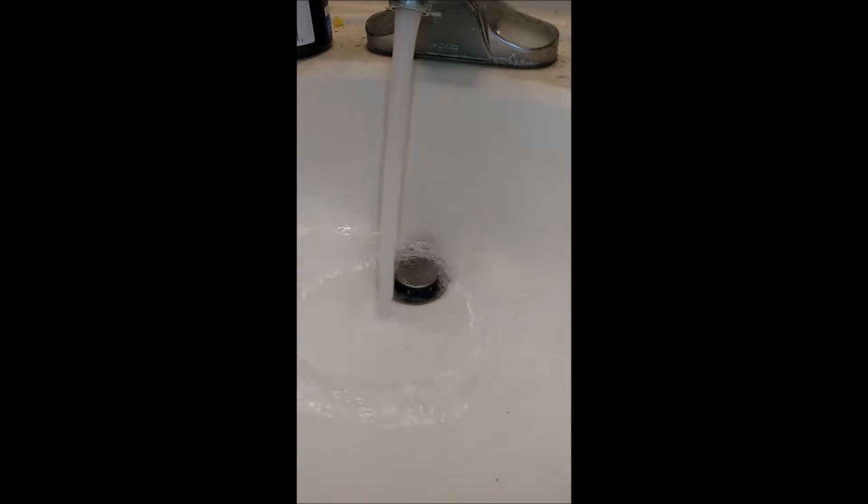We'll flush the toilet. You can see the water starting to taper off — pressure drops. One simple toilet flushing should not affect flow that much. It's a verified 50 psi at the entrance of the house; a flushing toilet especially one that fills slowly shouldn't affect pressure that much. Now if I turn on the other faucet at the same time, you can see dramatically how the pressure drops — just two faucets and a toilet going.